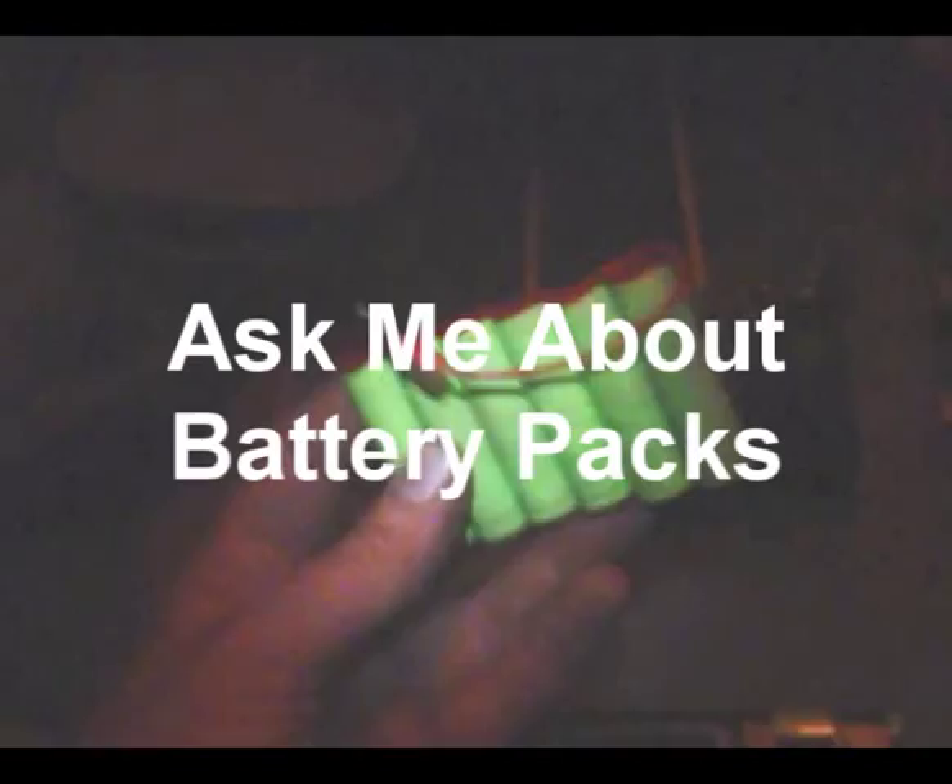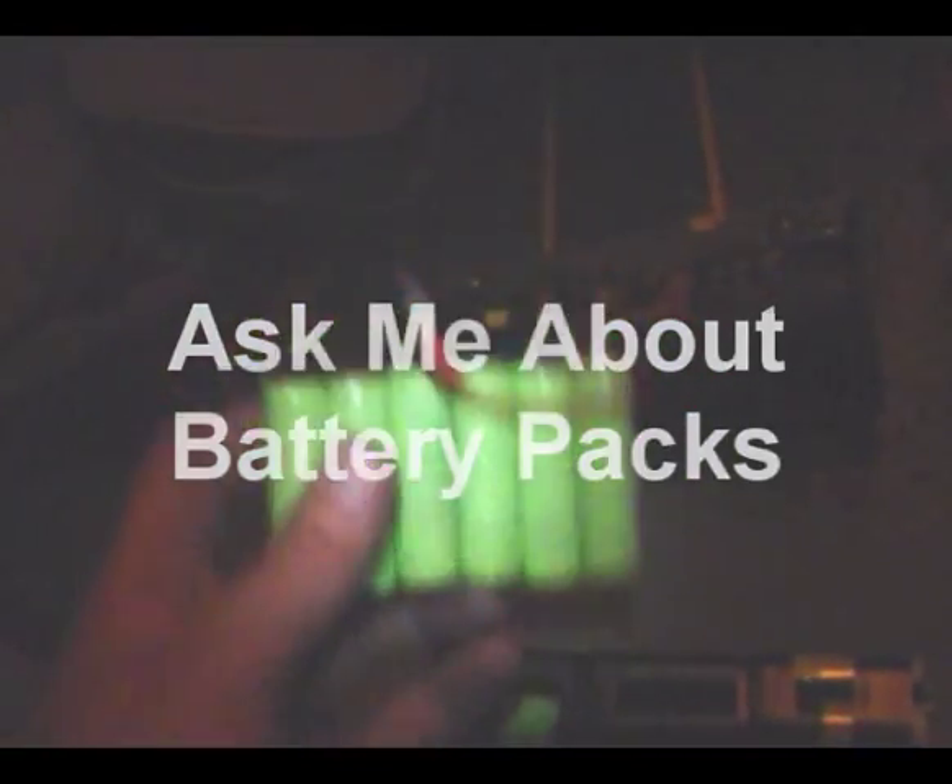I had a rechargeable battery pack. This one was actually twice as long when it started out, and so I cut off six of the batteries and reconfigured them. I just cut the little tabs that connect them — I didn't pull the tabs off, I left them on there so there'd be something to solder to.